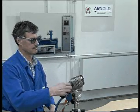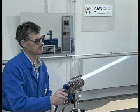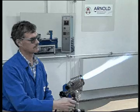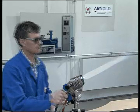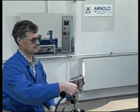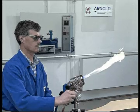When operating the burner with oxygen and propane, the oxygen valve has to be opened first. This generates a shining white flame in a cone. Via the air valve, a small quantity of air can be added to the propane gas, which will virtually eliminate the shining flame cone. To operate the burner with propane and air, close the oxygen valve and open the stabilization valve slightly to stabilize the flame. The amount of air is regulated via the air valve for the second operating mode.